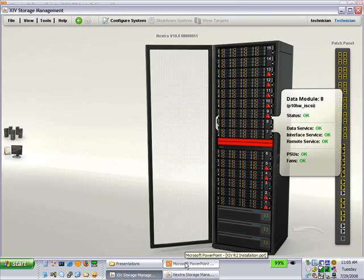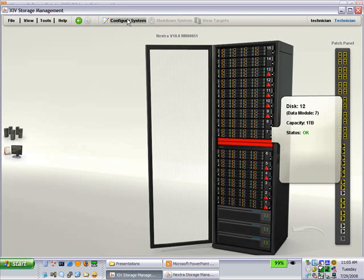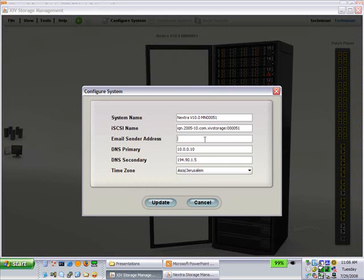The email sender address, is that the box's email ID? Yes, the email sender's address is basically because some customers have restrictions on their SMTP server, so to prevent relaying, the from address has to have a customer email address, or it won't allow the relay. It's basically acting as an SMTP relay. This is only if the customer requires it, and that should be part of your discussion during the initial call.